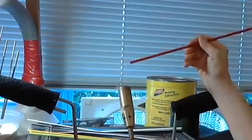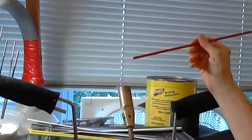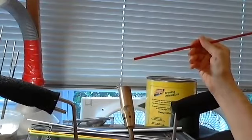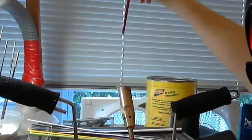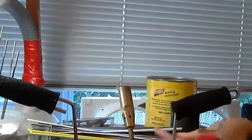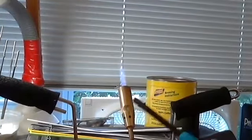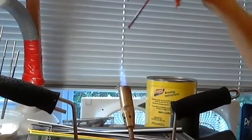She is going to be, so glass, let me start with this. Glass needs to be tempered or heated up slowly, or it will crack, which is called thermal shock. So Liz is going to be holding the rod vertically, and she's going to introduce it into the flame, moving just the end of the rod in and out of the flame. She's going to be pointing it away and down, because whichever direction the tip of the rod is pointed is the direction any broken glass will fly.